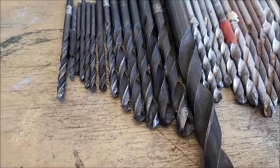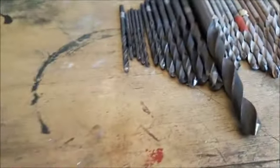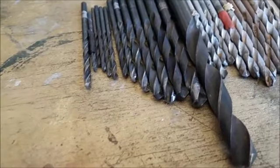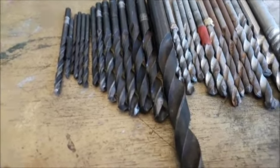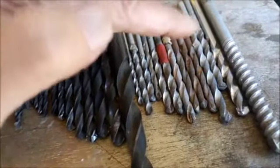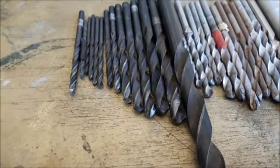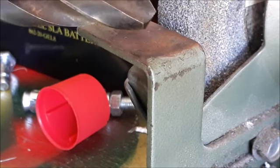Very sharp. I have a lot of drill bits and I've got a few more here. Nevertheless, I want to sharpen some of them now. You can see the shiny ones — those were already sharpened by myself on the grinder. As I remember from apprentice days, 60 degrees angle on the tips. This is a concrete drill bit, so it's not necessary for them, but I'm talking about these steel drills.